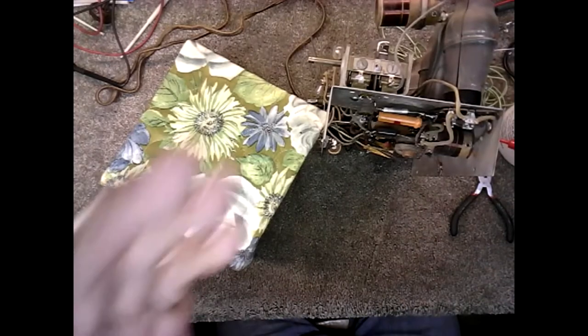Okay, let me take the phone, the camera down here, and show you what we got. This is the bottom of the circuit. We got a couple electrolytics here. They're not original, they're dry electrolytics, so somebody replaced those. We got another capacitor here. We got some miscellaneous cobwebs. Can capacitor here and here, and nice big dog bone resistors.